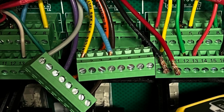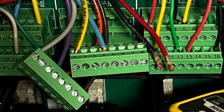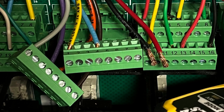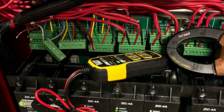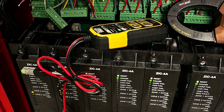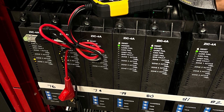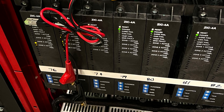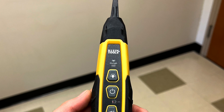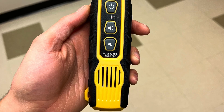I'm going to tell you what we did today with the fire alarm — troubleshooting and finding the end-of-line resistors. Using the codes and labels that were transferred over, we figured out which circuit was which. We disconnected the wires off the terminal blocks and hooked up the toner. We were borrowing this toner from a guy named Gary — shoutout Gary. Using the alligator clips, you basically create a tone, then use a little wand to walk around and figure out if something is on the same circuit by the signal it makes.